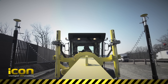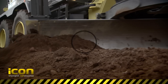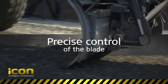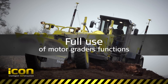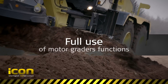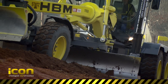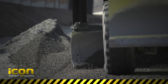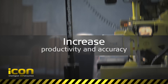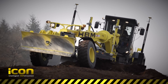The Leica Icon IGG-4 Dual GNSS machine control solution for motor graders gives you precise control of the blade, regardless of its position or articulation of the machine, allowing you to make full use of your motor grader's functions. Crabwalk your motor grader to properly handle material windrows and use automatic hydraulic control in applications previously impossible, such as creating ditches or grading side slopes. This new Icon IGG-4 solution increases your productivity and accuracy and gives you the opportunity to accomplish more site tasks than ever before.